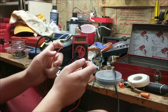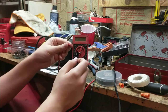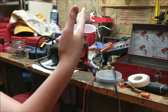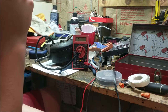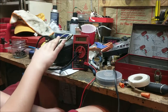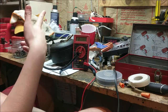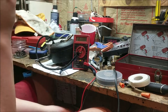To figure out if your stator is healthy on Emerson electric fans — and I'm not sure if this applies to every fan — you have three ohm readings: highest, lowest, and middle. Your middle and lowest ohm readings should add up to the highest. It can be off by two or three ohms and that's okay, but if it's off by more than 10 I'd be worried. Don't immediately call it a dead stator though, because bad leads can give you wrong readings.